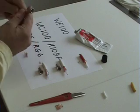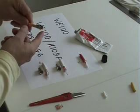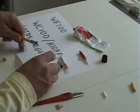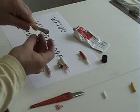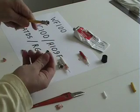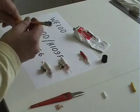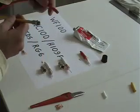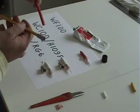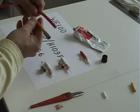Fitting an F-plug is easy, provided that you have the correct size plug. A lot of dealers will sell you a plug which they say is one size fits all — and that's not actually true, because if I try to put the RG6 one on, it would crush that cable down, affect its performance, and you could even lose channels because of it. So choose the correct plug for the cable. This WF100 cable, by the way, we stock in various colours including yellow, red, white, brown, black and green, which makes it really easy to determine which cable you've got hold of if they're all coming down to a common point.